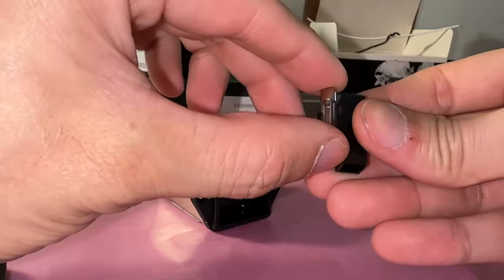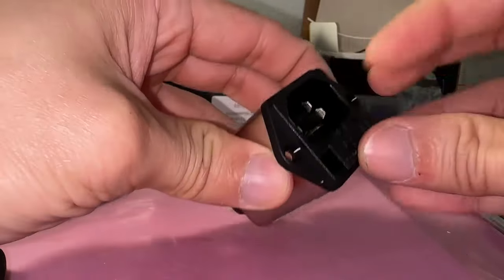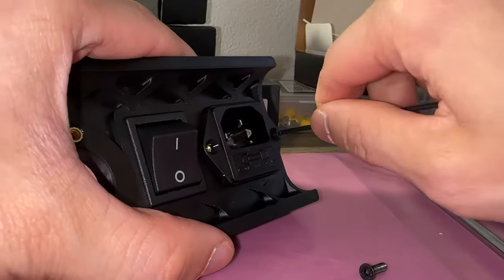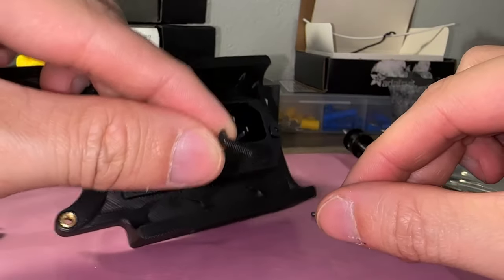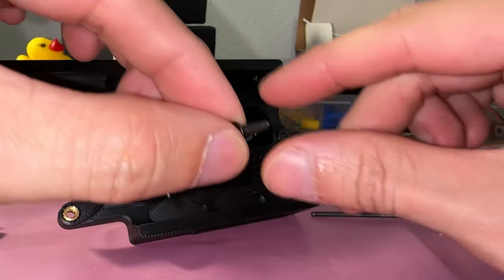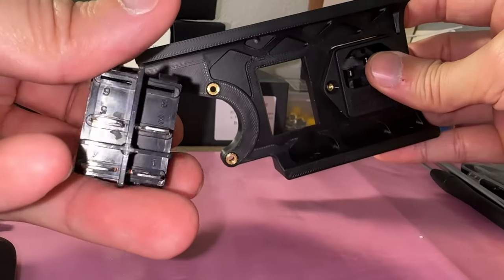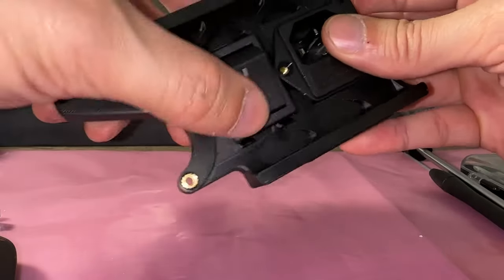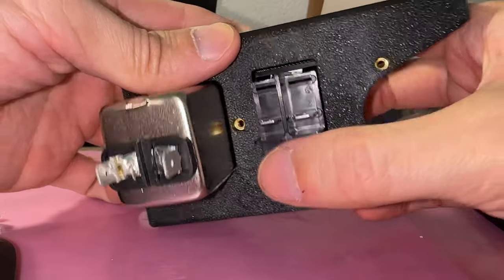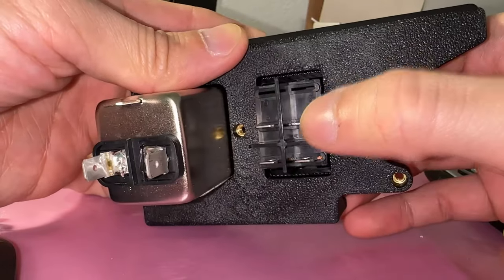For the filtered inlet, clip the fuse and slide it back in. If you're missing this M3x10 flathead screw, it's not listed in the sourcing guide — it's in the custom BOM and easy to miss. The manual doesn't clearly show the switch orientation so I'm installing it with the prongs on the lower side. I assume the power comes in from the bottom and switched out the top. Please correct me if I'm wrong and share the knowledge.